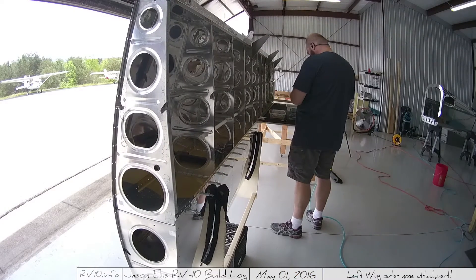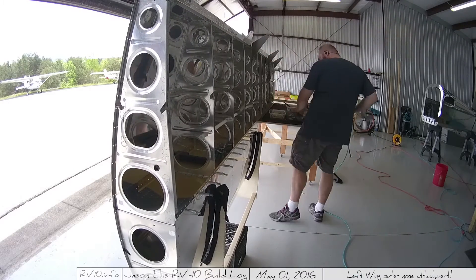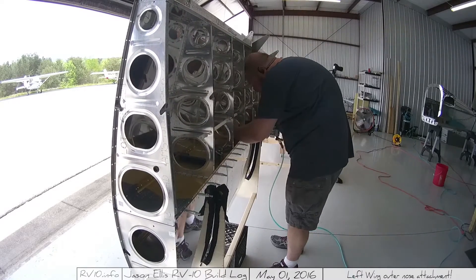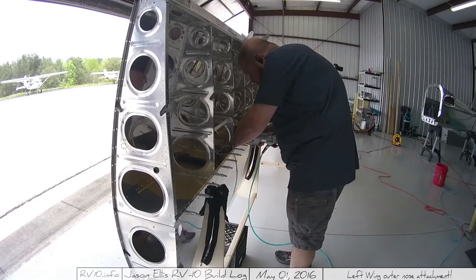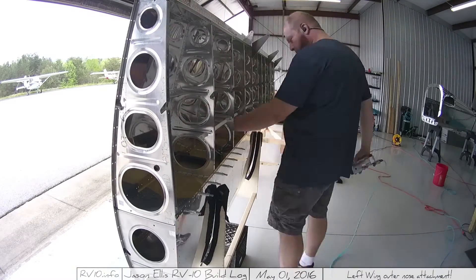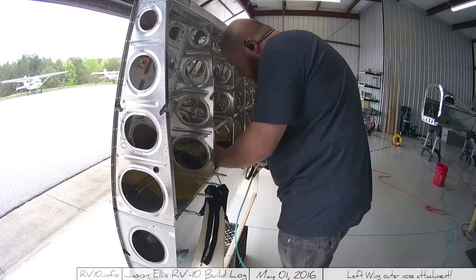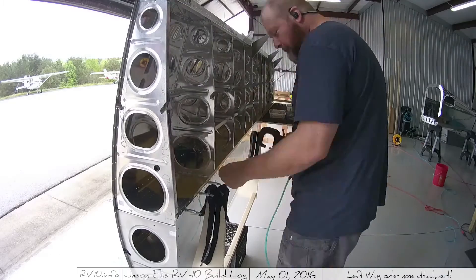To be fair, I'm not sure how pro that was. It's just something I noticed — if you put your thumb down there and use that to hold it in place, the rest of the thing moves. If you don't have something to rest that die against, when you use the thumb trigger, it just slides left or right a little bit. Originally on the empennage I had a bunch of pieces where I bent the rivet or it just didn't sit correctly and I had to drill it out. I'm probably going to do a whole episode on things I'm not satisfied with in the empennage and go back and fix them. That's something that's coming — there's going to be a lot of time between kits and parts.